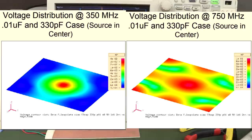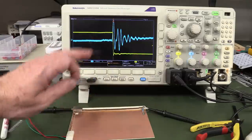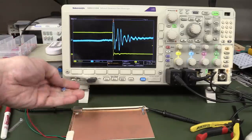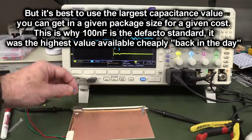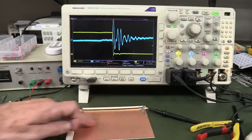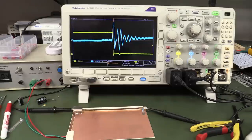As shown in the 'months in' video, there's an IBM research paper linked below where they've visually mapped the currents in ground planes — a very cool screenshot of that. It really does matter where you put your bypass capacitor and why it should be near the chip. There's a whole lot more involved — it's not always that simple — but that's why it's a good rule of thumb to have a bypass capacitor nearby each or groups of chips in your digital layout. The value isn't that critical in most cases, though it varies depending on whether you've got a full ground plane.